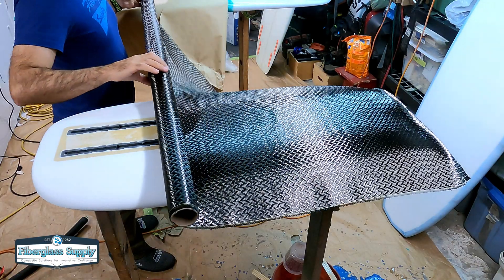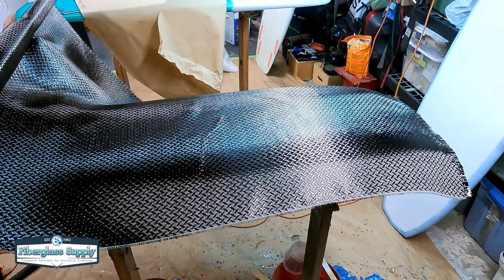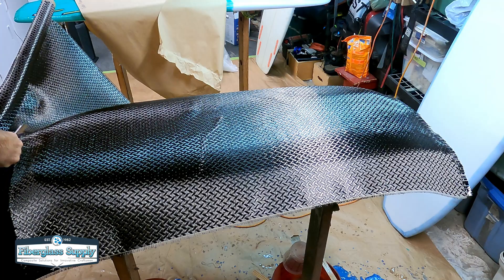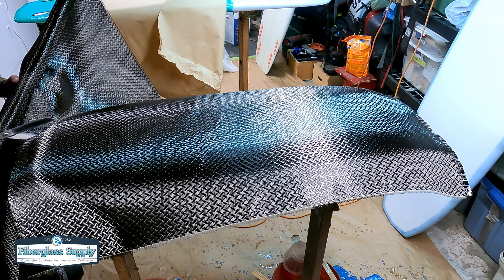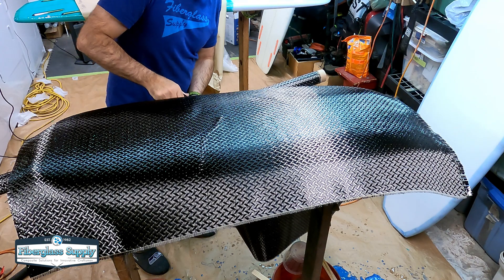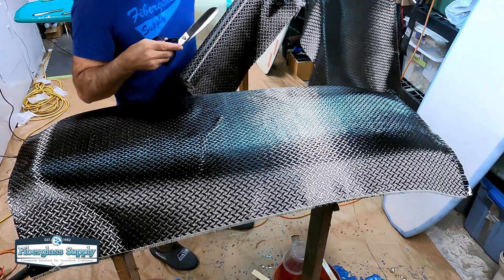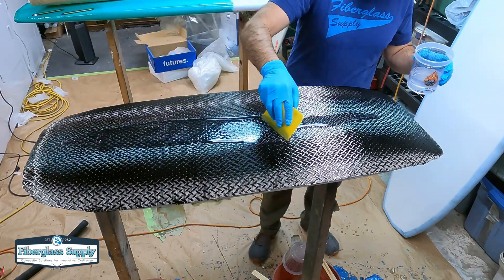There are a couple of reasons I am doing that. I don't want to go with a single layer of reinforcement — I think it would be too thin. That layer of carbon is 6 to 8 thousandths of an inch thick, and the layer of glass is about 6 thousandths of an inch thick. So I want a little more meat on the bottom than just a single 6-thousandths layer. The other reason I am using glass for the second layer over the carbon is that it will help hold the carbon down — carbon tends to be a little stiffer and can spring back. One option would be to vacuum bag this, but the board is so small and already pretty light that I don't feel the need for the extra hassle.